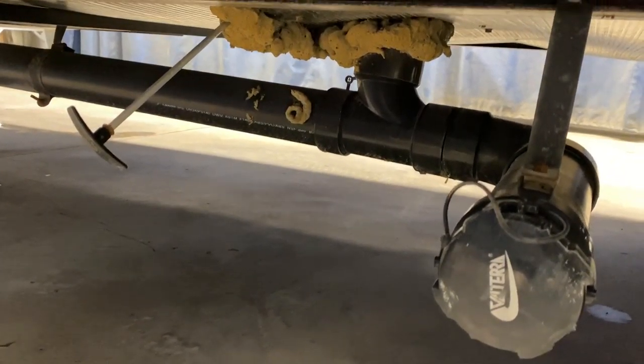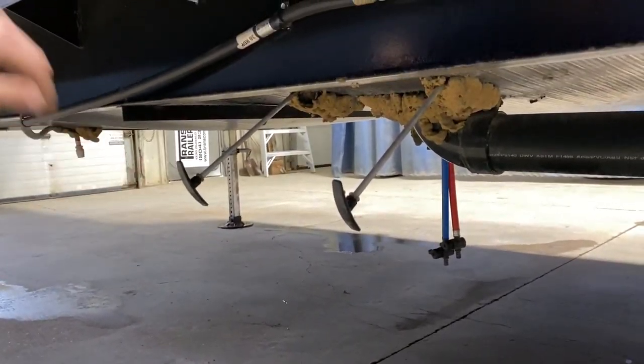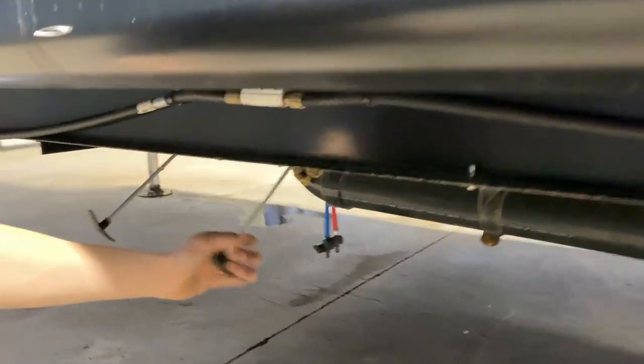The bumper here, you can just pop that end cap off, reach your way in and you've got a sewer hose in here. It does stretch out to 20 feet once it's fully extended. Just take note of those two ears right there — that is how it'll attach to your sewer system. Keeping it stored in the back bumper here just helps keep the stench out of the trailer and keeps things cleaner.